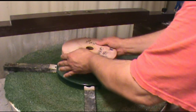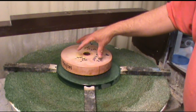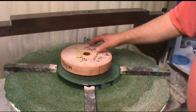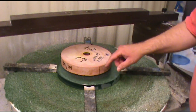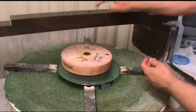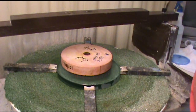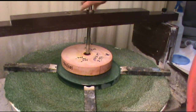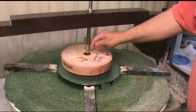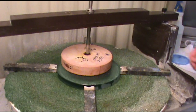I've preset this machine so that I have about one inch of overhang. This is a nine-inch diameter tool on an 11-inch mirror, so with an inch of overhang I'll have about three inches on the other side, which is enough to feed abrasive in. I have a five-eighths inch stainless steel rod that goes down through here and posts into a metal socket on the back of the tool — nothing holds it in there, it just drops down in. The socket is a little bit bigger in diameter than the rod.